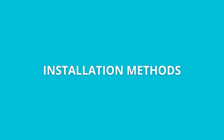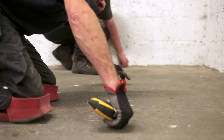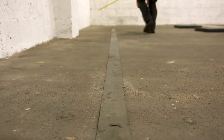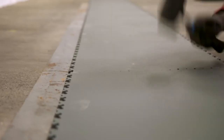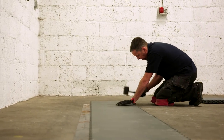Installation Methods. To begin preparation for laying, you will need to measure the area and insert a chalk marker line. Alternatively, a straight line tool can be used for the same purpose. The tiles are then laid out in stacks to facilitate covering the area. We recommend for open joint tiles you start in the center of the room and using your chalk line work out to meet the walls.